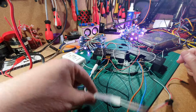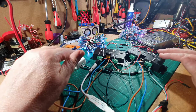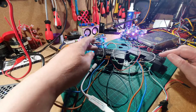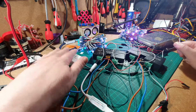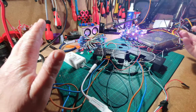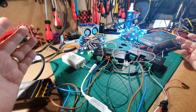And then this LED controller here is outputting on the very end one to this bunch here. So how come that this box here can output 2 different signals to LEDs? Well, that's what the beauty of these little two boxes are. You could have just one controller here, and it could output to 4 channels here and 4 channels here. So you could actually output one controller to 8 different sets of LEDs if you wanted to.